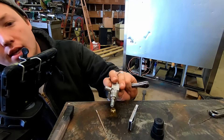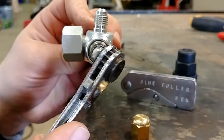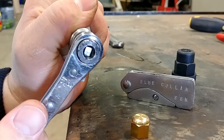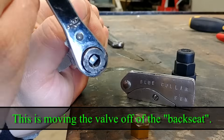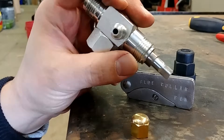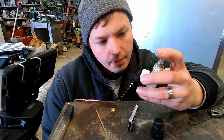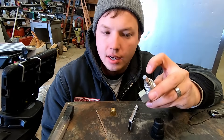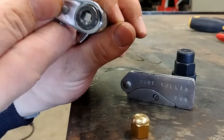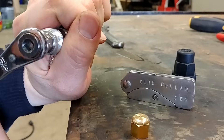So now you obviously want to access the refrigerant system, so you need to get this to open. And the way you do that is by actually closing the valve just slightly. I'm going to put this in the right direction and now I'm turning it clockwise — about a half a turn, two quarter turns, is enough to then be able to access the refrigerant in the system. You can see that it blows through the side port just fine. So that is how this valve works: when it's all the way open it closes this side port. When you open these up you're supposed to put a little bit of pressure on them, because when they are all the way open it actually helps it seal better.